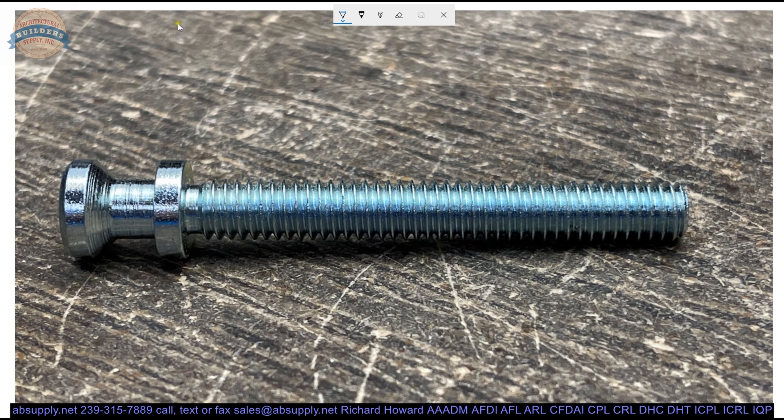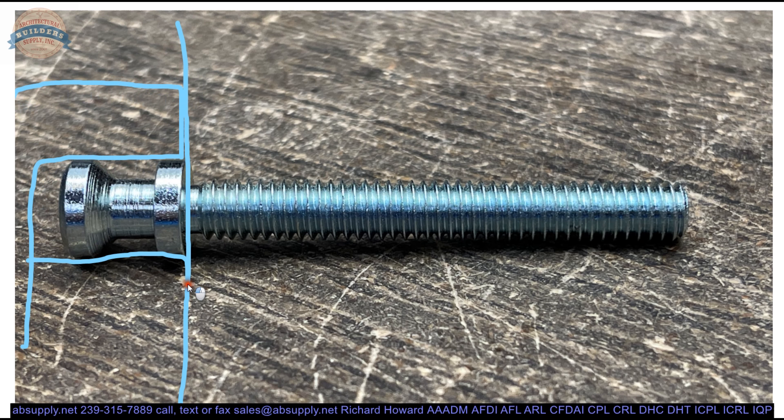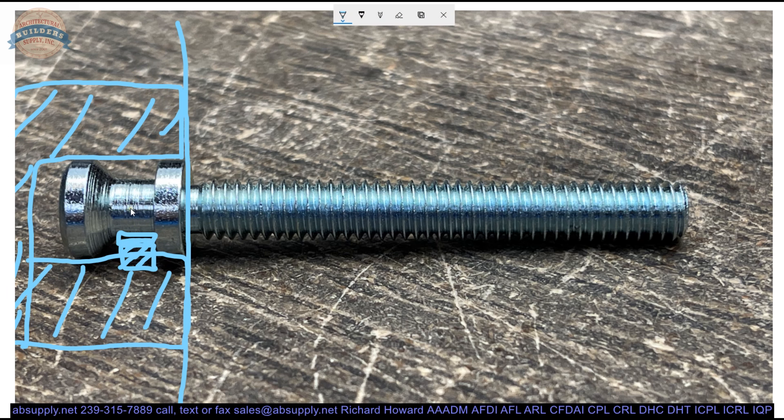So here is your door — that's your door. Obviously your pull handle is going to sit something like this, and that's going to come back here. This is then going to have a hole drilled in it where you'll have a set screw that will fit inside and rest into this area, holding that inner pull handle to the cone bolt. That's how that's going to work.